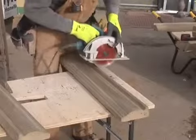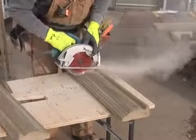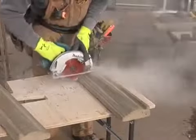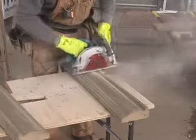Cutting moldings. Cutting molding is similar to cutting tiles. Here it is important to allow the saw to cut through both ends first before you finish the cut. That way you don't need to deal with unwanted breakout on either end of the cut. Hold the saw at a right angle to the molding.